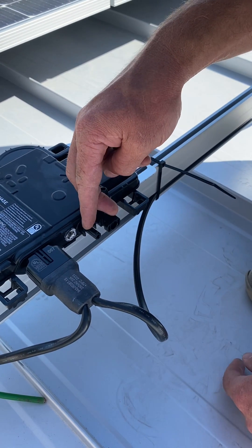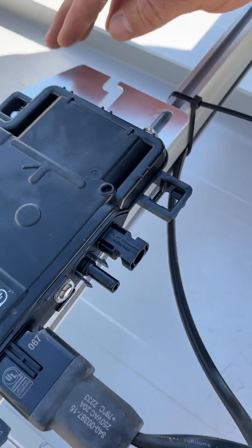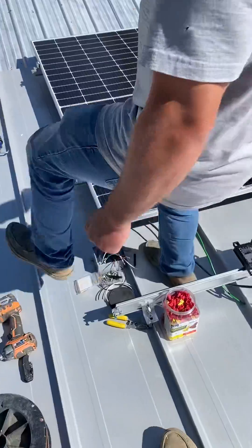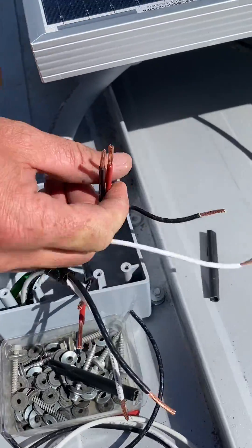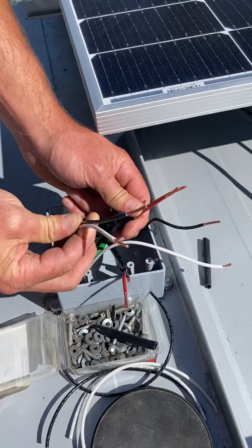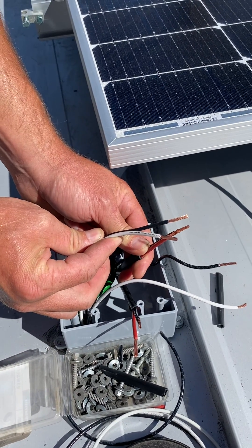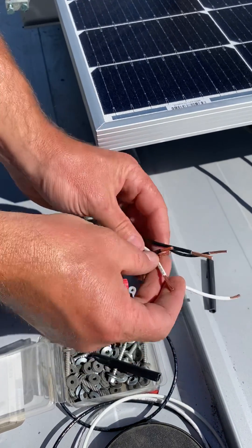Your solar panels will connect in here, and then your trunk cable will come down into your junction box. Here's one trunk cable right here and that's just going to hook up to 220. You've got your breaker right here and your trunk cable right here, so it's a 220 volt, 240 volt system — and these will get wire nutted together like this.